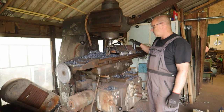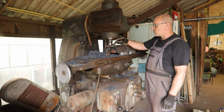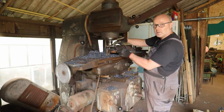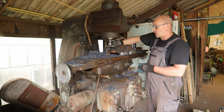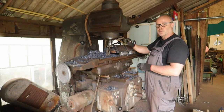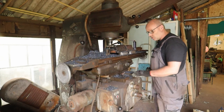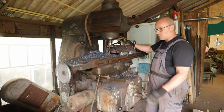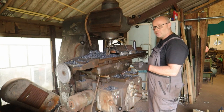So when I was at this end, I measured over here. You could see that I used a square, because I have to measure an angle because I welded the strip on. So I used the square to measure. I have the thickness of the square. So I could see that was about a millimeter off, just under a millimeter. So I'm about 3/10 of a millimeter off now.